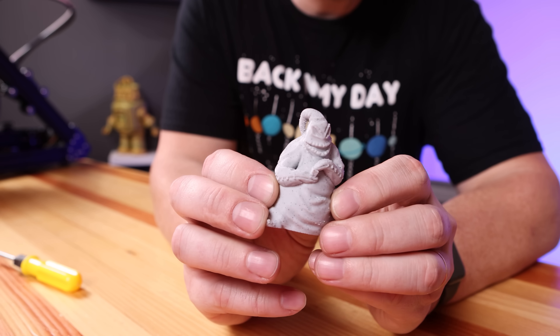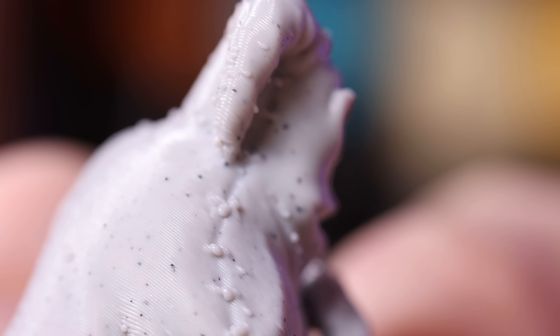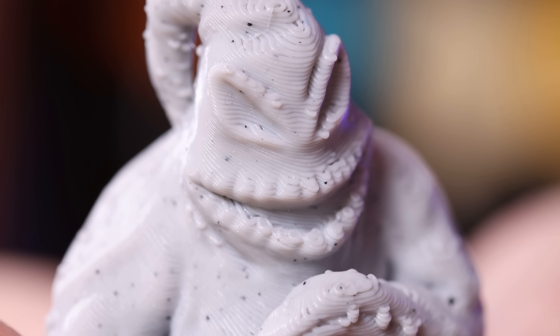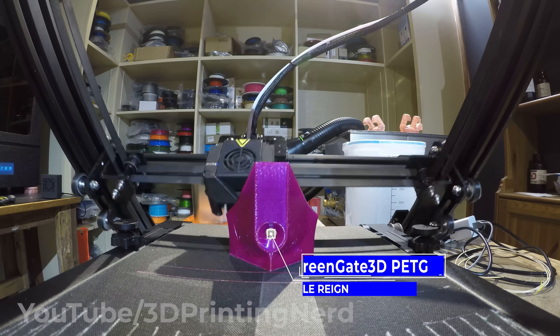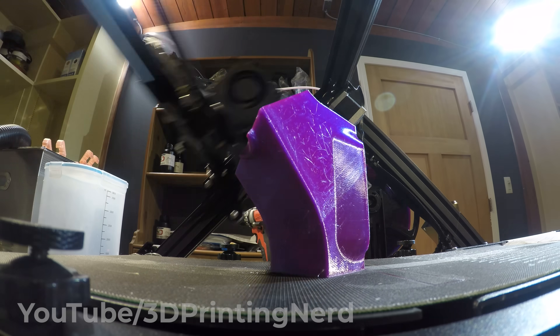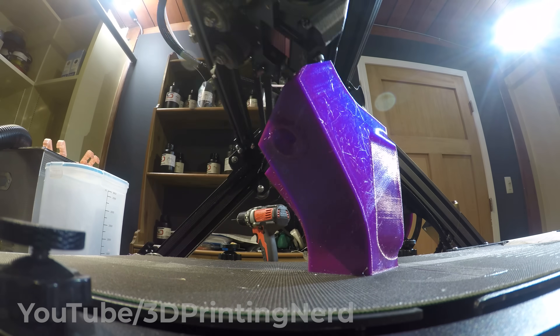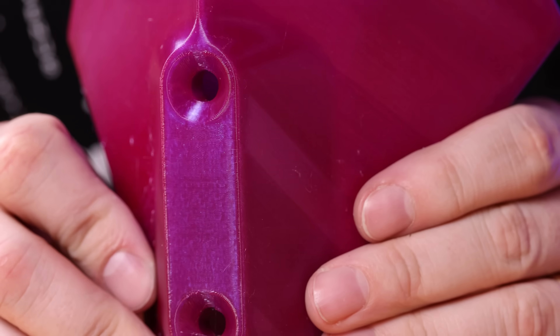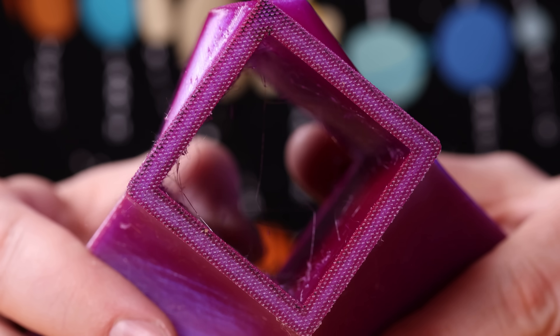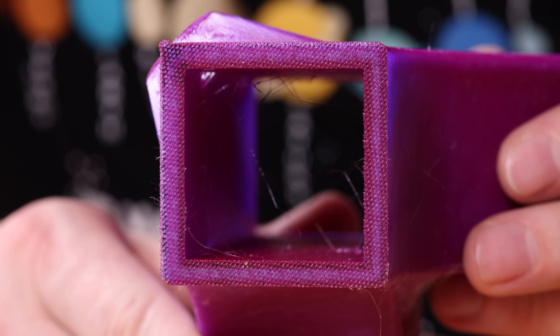You saw the Oogie Boogies from the Halloween video — those turned out great too when I used the right profile. A lot of people asked, can it print PETG? Yes, it can. These Alexander Chappelle camera arm pieces are in Green Gate 3D's PETG. I think it turned out decent. For these I used the PLA profile, upped the temp to 240°C, and upped the belt to 70°C. A little stringing on some, and some wisps, but that's easy enough to clean up.